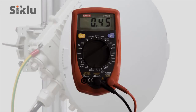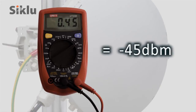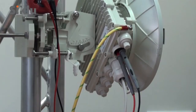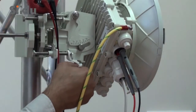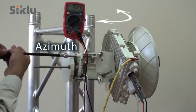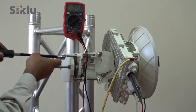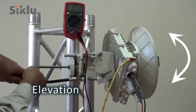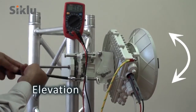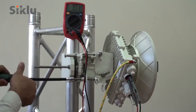The voltage reading will be between 0 and 1, indicating the RSSI in dBm. For example, a voltage reading of 0.45 is equivalent to an RSSI of minus 45 dBm. Ensure that the elevation tension band is connected to the tension pin. To align the antenna, sweep over both azimuth and elevation such that the antenna's main lobe is pointing at the remote ODU. The azimuth and elevation are adjusted by using the fine adjustment bolts. The objective is reached when the RSSI is within plus or minus 4 dB of the pre-calculated value.